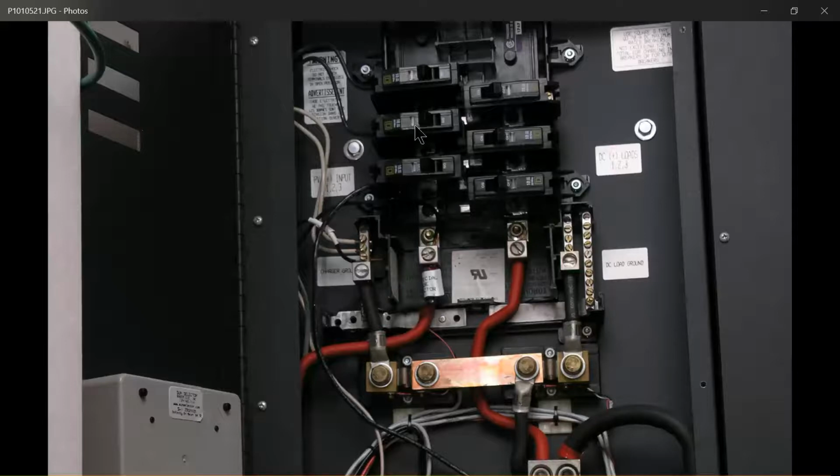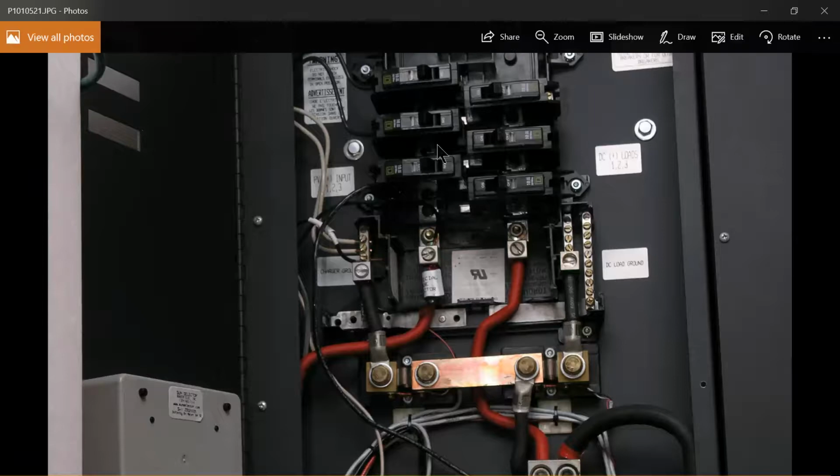That would be on the same bus. But, of course, then the cabinet would be improperly labeled, and he's got this split in this fashion. And most people don't need more than 3 input breakers in a little system like yours. So in any case, that's where the PV comes down, and then of course it comes through those breakers and into this cable, which goes to the other side of that mercury contactor you're removing.